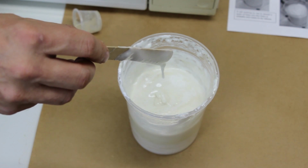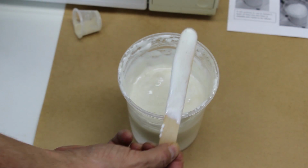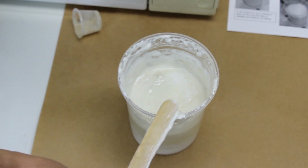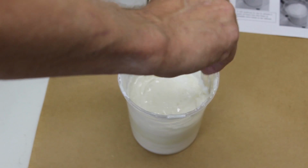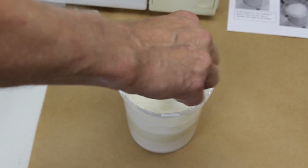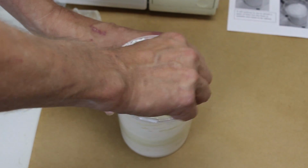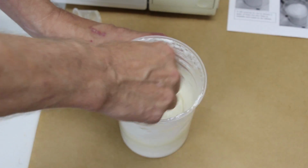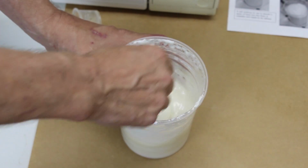While you stir, you will notice that larger bubbles will begin to rise to the top of the foam. Refining will break these larger bubbles into more desirable smaller bubbles. This action is similar to that of refining foam latex. The refining process is where you adjust the density of your foam. The more you stir, the denser the foam will be. I usually like a more fluid than fluffy foam, as it is more translucent while having air in it.